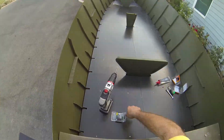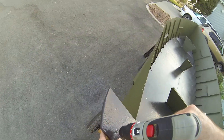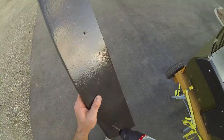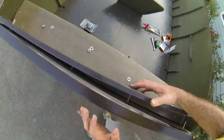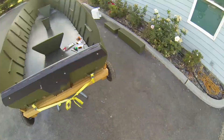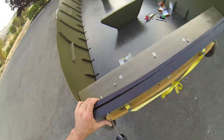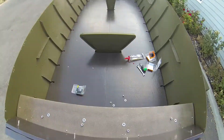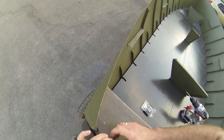Then I had the inside piece, which had the same problem. I had to drill those out and make sure that the paint and coating down in the bolt holes was back to the original dimensions, then everything lined back up. Once I pounded it together, all the bolts from the outside lined up with the holes on the inside. I put big washers and big quarter-inch stainless bolts on the inside, everything lined up, and I tightened those down.